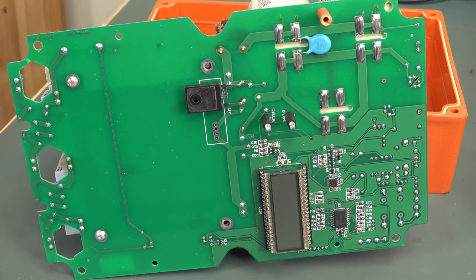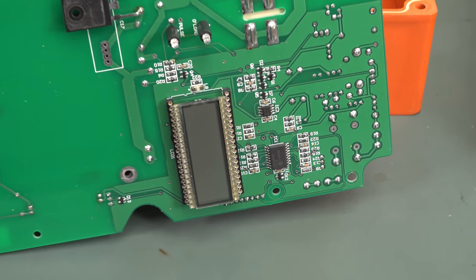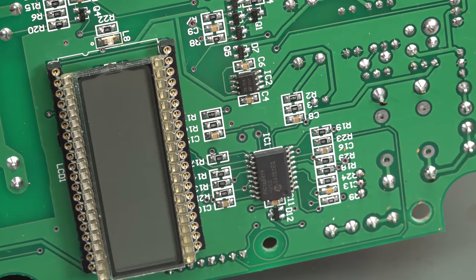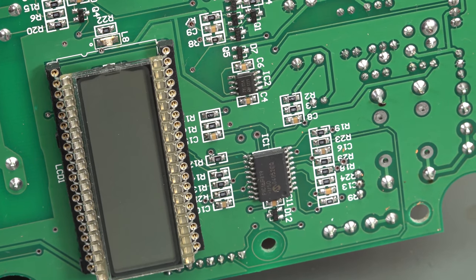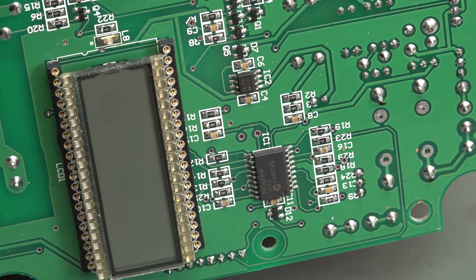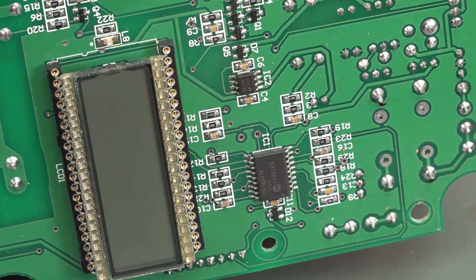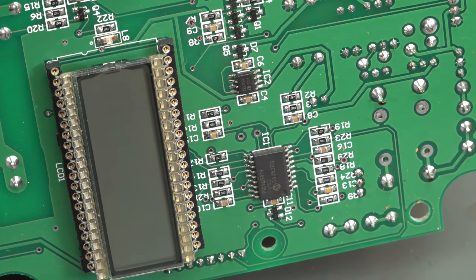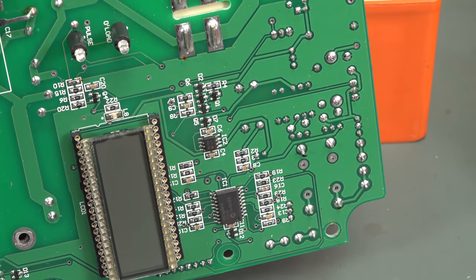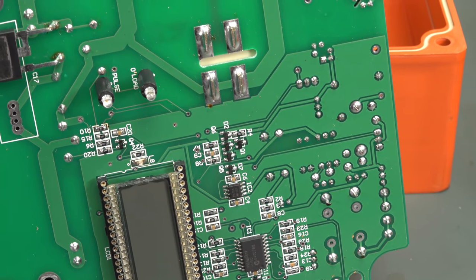Well, there you go — I spoke too soon. There's your microcontroller down there! All the PIC fanboys go wild. What one is that? A PIC 16F series, given the vintage of this sucker. And that's just driving the LCD. There are some extra surface mount chips under there — they'd just be LCD drivers, because the PIC wouldn't have direct LCD drivers and there's not enough pins anyway. There's probably a little op-amp in there too.